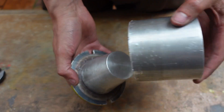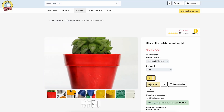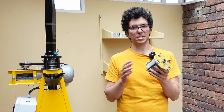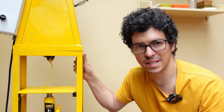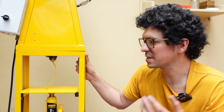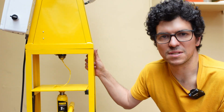Today we're going to use this mold — we're going to make a plant pot. You can find it in the bazaar. This is a very simple mold; you can use it with the basic injection machine. But remember that with this machine you can make more complex molds. Unlike the basic injection machine of Precious Plastic, this one has a connect nozzle because it's very easy to use and makes it a faster process.